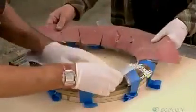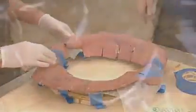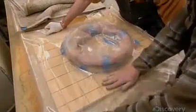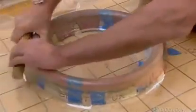They add a layer of protective plastic followed by rubber cushioning to protect the veneer surface in the next machine — a vacuum press. Powerful suction draws the bag tightly around the materials, locking the veneer onto the plywood substrate and forcing out any air in between them, which would hinder full adhesion.